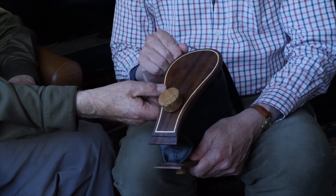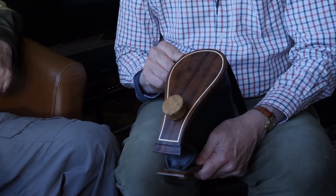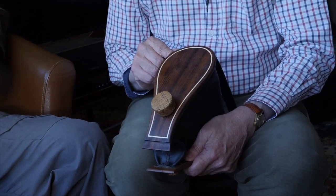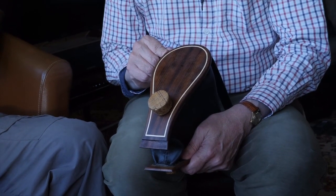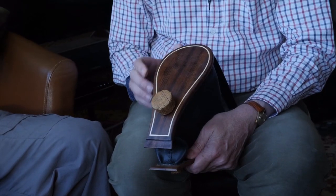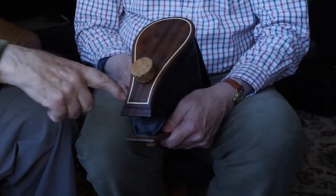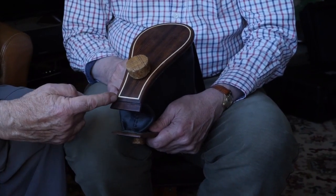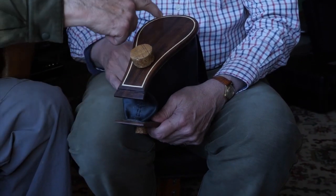So do you put any glue in or anything first? Yeah, always. It's a white glue. Is it the PVA? It's PVA, more sophisticated stuff, but that kind of stuff. Yes, I'd fill the whole groove with glue, and then start. I'd miter the corner, yes, and squeeze it into the groove all the way around.